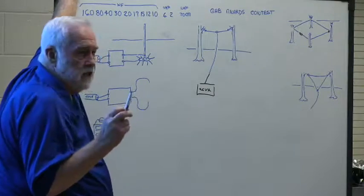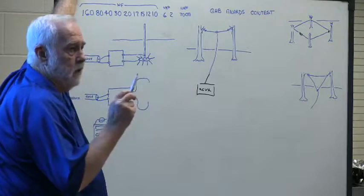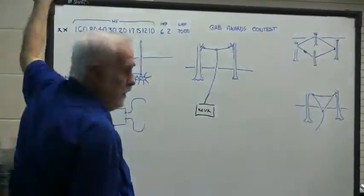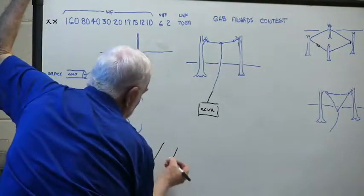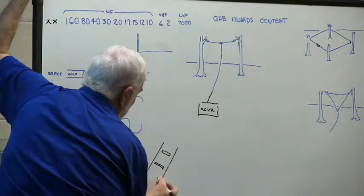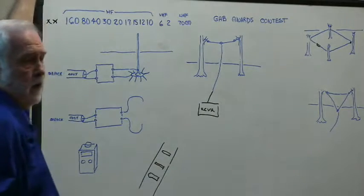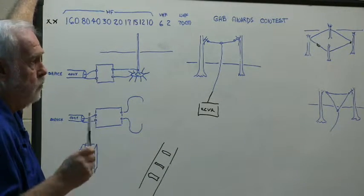There'll always be some loss. Every transmission line will have some loss. I'll come back to the minimum in just a minute. Let me talk just for a minute about transmission lines. The oldest, actually older than I am, is what's called open wire feed line. You have two conductors. This came about in the First World War and was used extensively then.